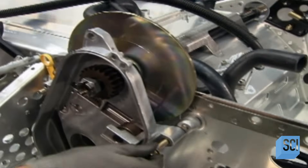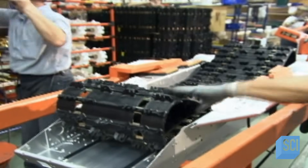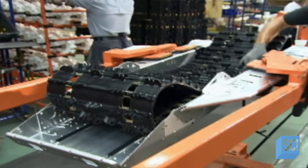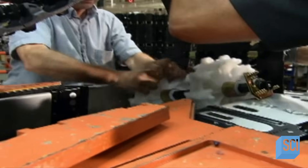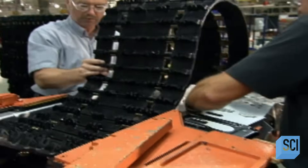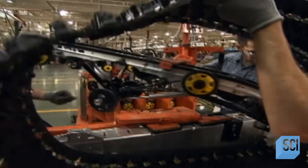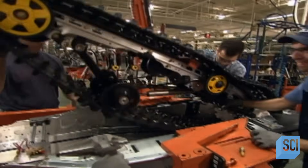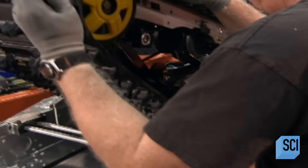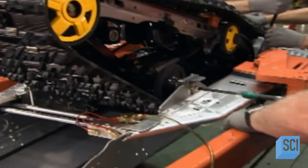The transmission fits on top of the frame. Coils, springs, runners, and wheels fit easily into the rubber track. The rear suspension system connects to the track system, while a white plastic sprocket connects the track to the transmission. A speed sensor attaches directly to the sprocket. Four high-grade steel bolts anchor the rear suspension system to the frame — strong enough that the suspension can withstand the vibrations that come with high speeds.